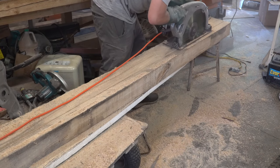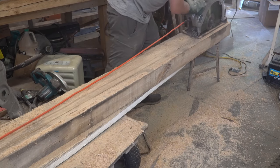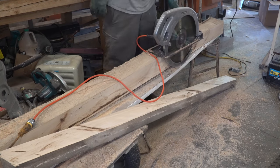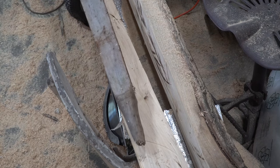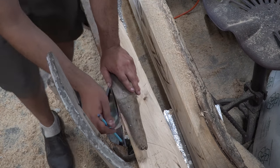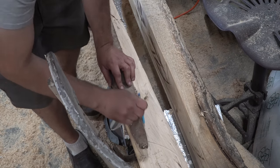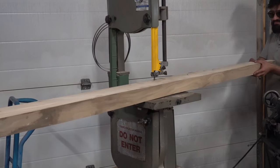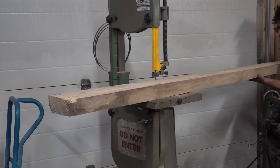Let's get started. I am working on the wooden portion of the frame of the drag saw. It is going to be completely remade, left rough as to look old, but completely new out of Elm. It's something that I have locally here. I actually milled this piece of wood myself and dried it myself. It will be much heavier, much stronger than the original pine or fir or spruce — some sort of soft wood.